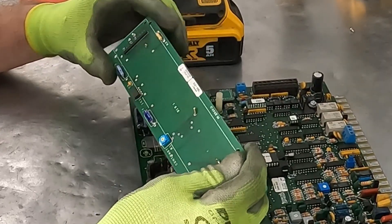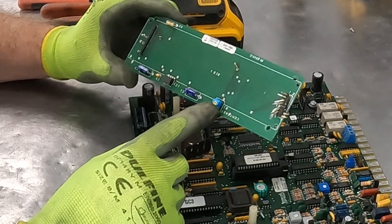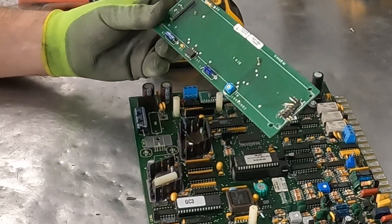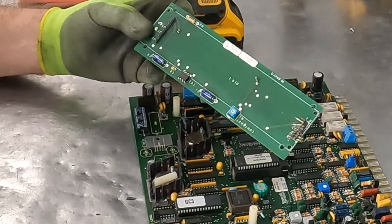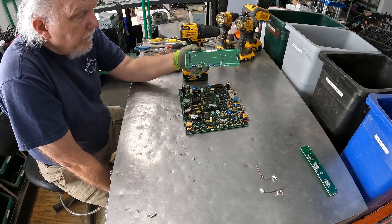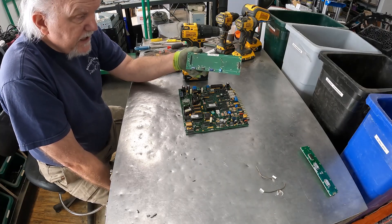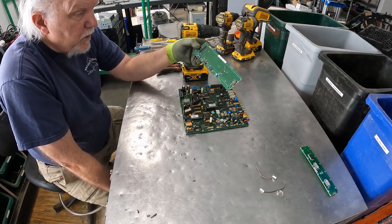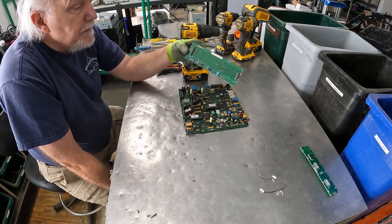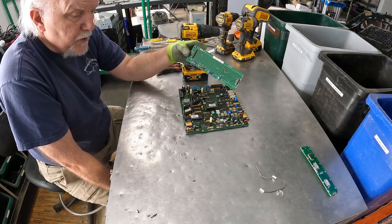We have over here on this side an IC, some capacitors, a tweaker knob — in this case it's a resistor — and over here is another resistor. So there is visible gold and an IC, but there isn't a whole lot of value here, so we're going to call that peripheral low-grade. Some yards would call that a mid-grade. But remember that mid-grade versus low-grade is a huge difference in the yard that you're selling to. Boardsort.com is the same price for mid-grade and low-grade, but I do have another buyer where mid-grade is substantially different than low-grade. Their mid-grade classification is actually closer to a peripheral classification on Boardsort. So you really need to know your buyers.